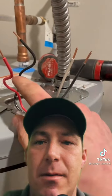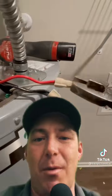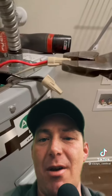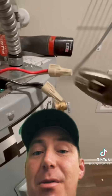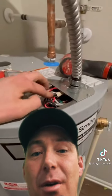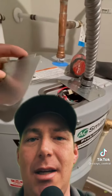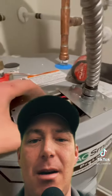He's hooking up the wires here and there's nothing wrong with what he did there, except when he went to tighten up the wires. I don't like how he cranked down on those wire nuts — it's always good practice to just pre-twist them. The internals of those are not made to crank down like that. He's got everything tucked away and he's about ready to wrap this up.